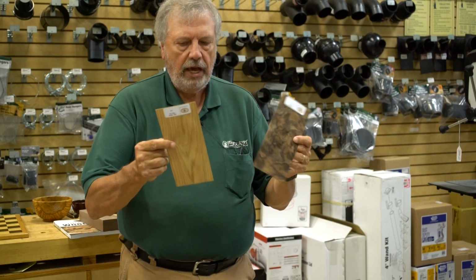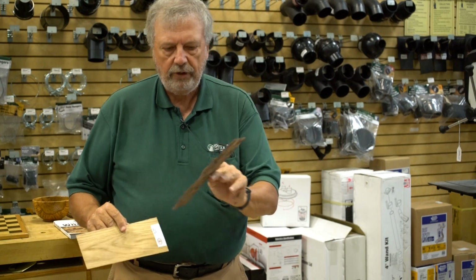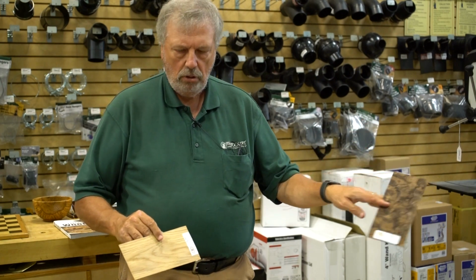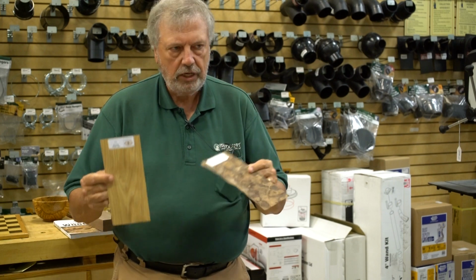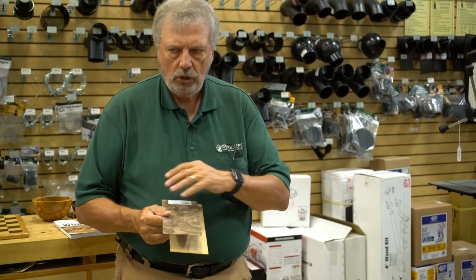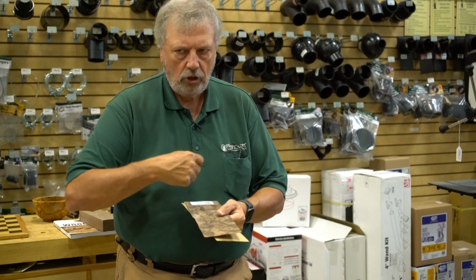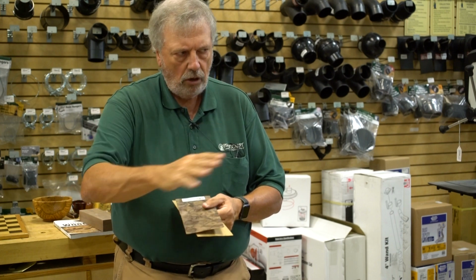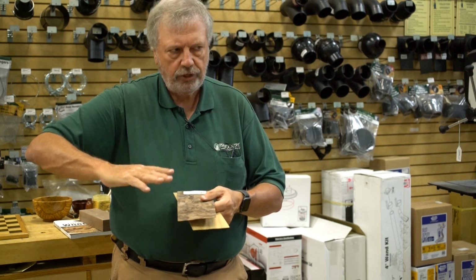So know that when you look at these things, they should remind you that if I found some beautiful walnut burl, it's going to be curly, and it's going to be tough to work, because the wood's going to want to tear out. So when you get this down to the finish, you're going to be using a card scraper to get all the tear out, and then you're going to be using a high grit sandpaper to flatten the little tracks from the card scraper.